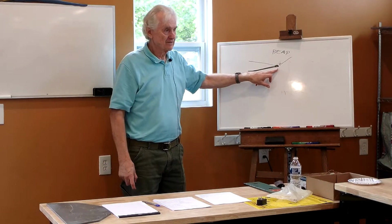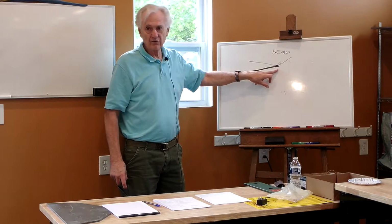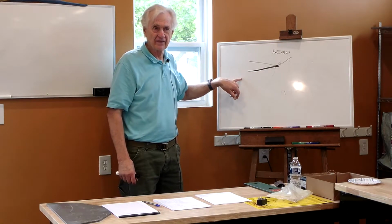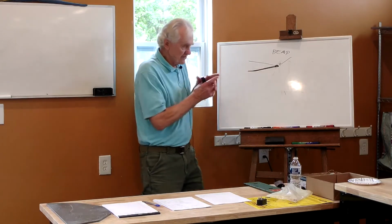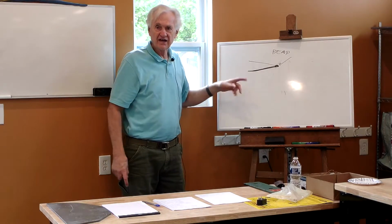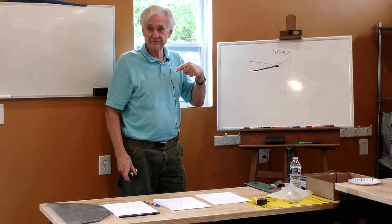Is it like electrons jumping from the metals? Different levels, yeah. So just any two metal wires of different composition connected together, when I heat up the connection, it generates an electric current. So this is my thermocouple. When I stick these joined wires into the kiln and it gets hot, it sends back a very, very small electric current, and you measure the current. And the more current there is, the higher the temperature.